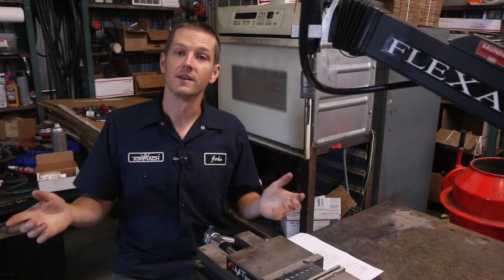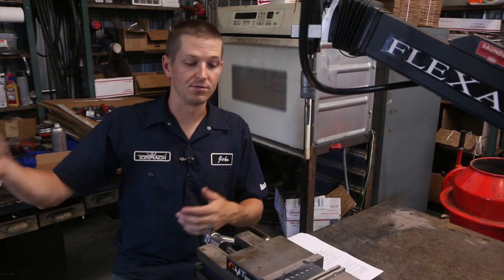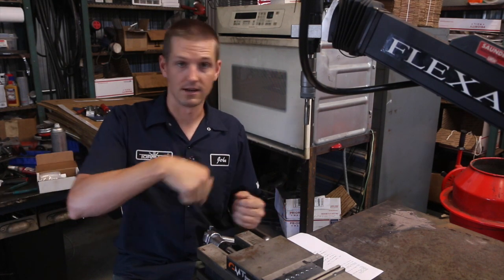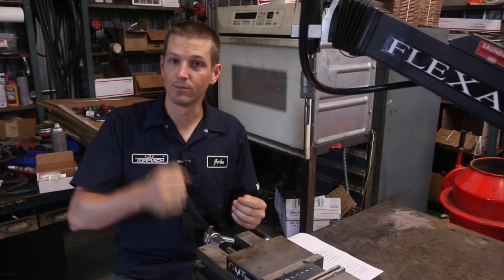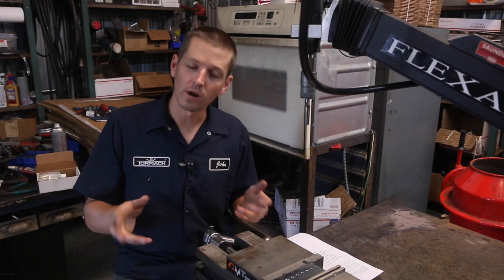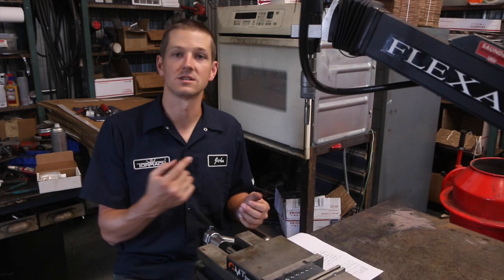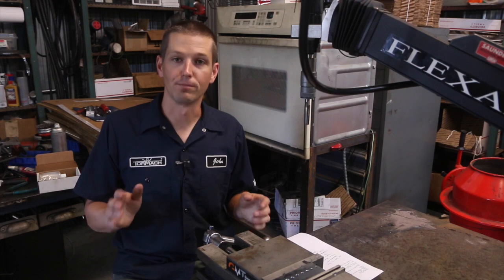When you get into bigger machines, the sales pitch is: free up that machine to be doing better, more productive stuff. A lot of times you've got operators sitting in a cell, running a couple of different machines, where they can be deburring, checking QC, tapping parts offline. And I'm told — I'm curious to learn more about this — that rigid tapping is very, very cool, but it can be hard on spindles to start and stop that fast. Maybe that's wrong, but it's certainly an interesting point.